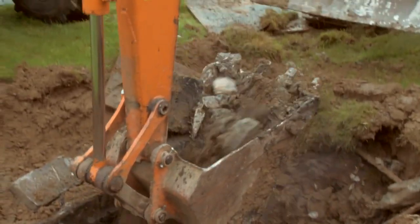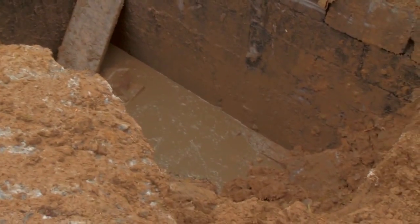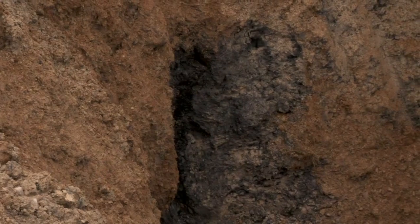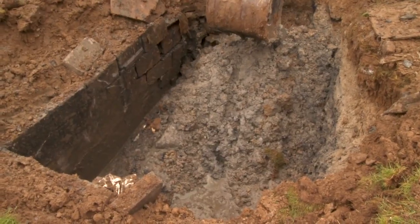As you can see, the blocks are all bulging. There was water coming in every side. As far as I can see, the percolation was put in around the tank and it's all black in colour at the moment. That is typical of the way they were done 20 years ago.